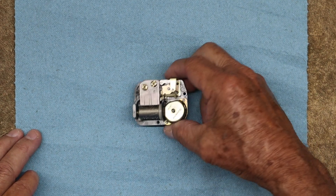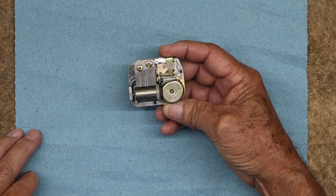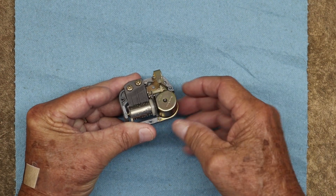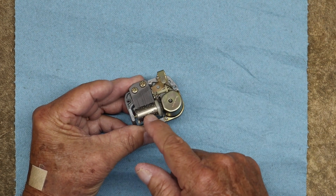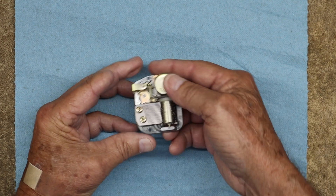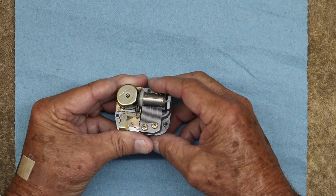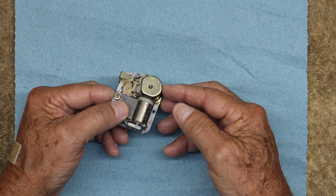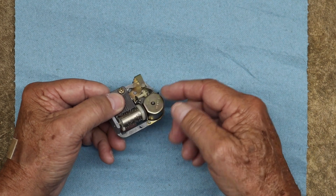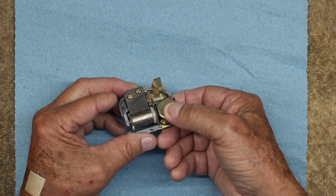The other day I ran across a couple of these music box mechanisms. These are some older ones — I don't think they build them quite as good these days, and some are even electronic. But they're very interesting the more you study them. This one has a flat spring that winds up to power it, a drum with bumps that creates the song, and a tone bar that creates the tone as the drum rotates past it. Because it's spring-loaded, you need a mechanism to regulate its speed — a series of gears and a little paddle wheel that moves through the air.